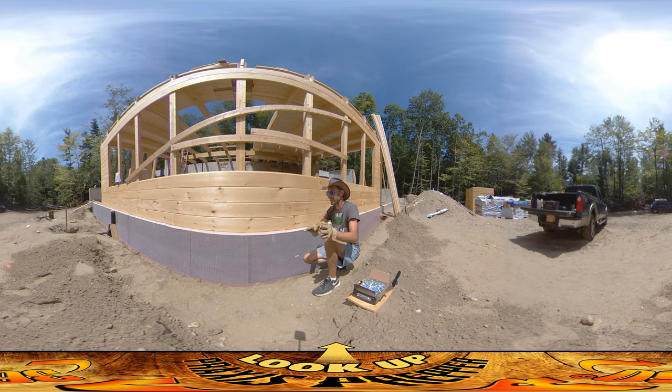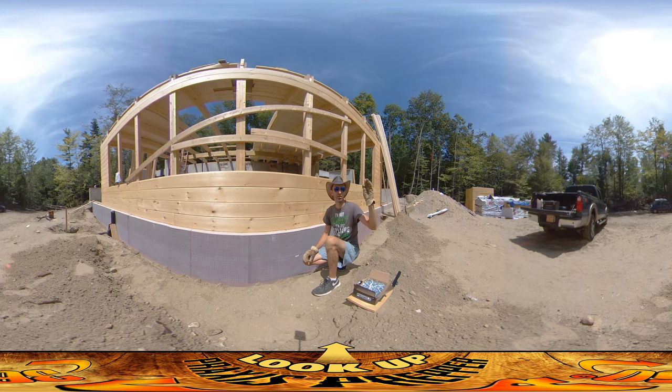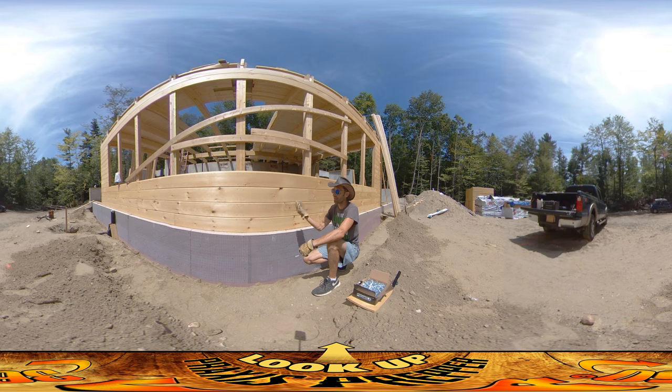As soon as I'm done with this and we get the Tapcon screws in there, the next thing I should be doing is getting the stucco on here and then I can start backfilling. Unfortunately we don't have electricity on site yet — we have a generator but not enough to run the well pump — so I don't have easy access to water. I think I'm just going to leave this trench open and hopefully within the next couple of weeks we can get electricity, then I can have access to water and mix the concrete stucco here. I'll show you that when I do it. Thanks for watching.